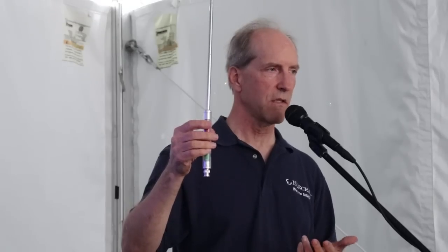This is the whip part of the antenna. The combined length is roughly 51 inches, and you attach the whip like this. There are other antennas like this available, but we have the only one that covers two bands and more. It breaks into two pieces so it fits into the small bag. This antenna will be supplied either as a kit or assembled, continuing Elecraft's tradition — most of our products are available both ways.